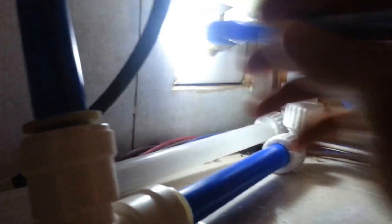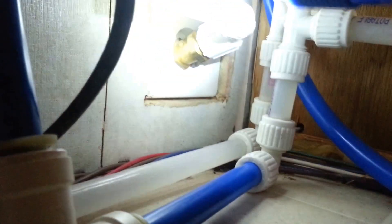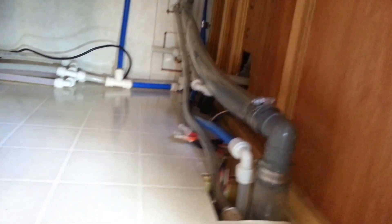Whenever those come, I'm going to install them probably right after that valve there and then I'll be able to monitor my water consumption. There is also the pressured city water line coming in — if you're at a park you just want a hose hooked up and use the park's pressure. Right now I have it detached since I'm mostly using the pump, but I do want to hook that back up. This fitting here might be either a check valve or a pressure reducing valve — it's a cheap little thing, and I'd like to put in something adjustable with a pressure gauge. I'll figure that out when I get in here for the flow meter modifications. But for now it seems to be working pretty well. I didn't have much fun working in this space, but it's better than it could be. So, until next time.